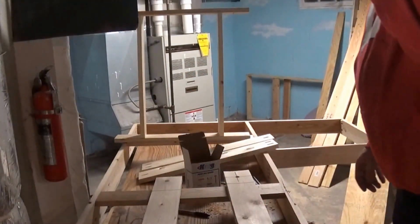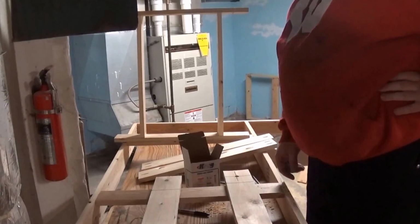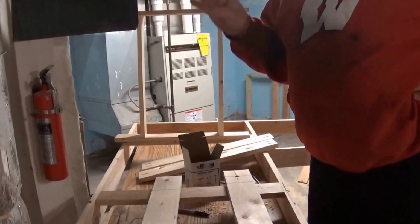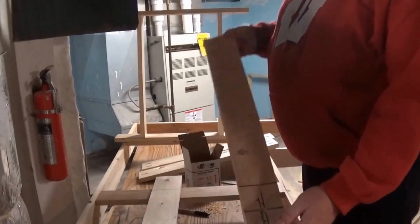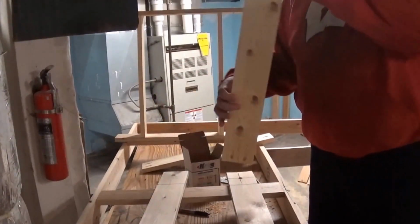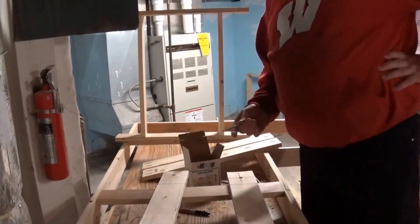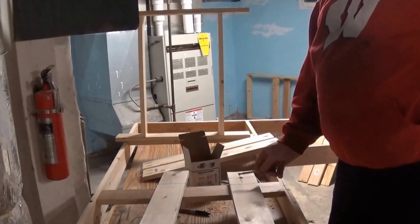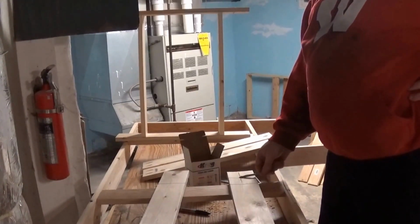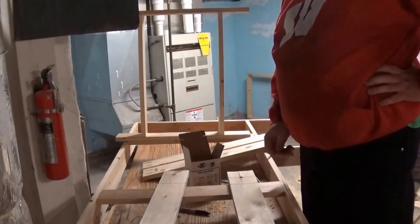Okay guys, so I was just going to do a short video on how I put my legs together. I've had some problems with recording. I ended up with my card being too full, and I had to restart the video. Anyway, this is going to be the foot, and this is going to be the top unit. These units here are my center spars that go in between. They're approximately 24 inches. Actually, mine aren't 24 inches exactly. But what I did on this is it's exactly 5 inches from the edge of the board to this black line. Same on this side from the black line to the edge of the board. It's 5 inches. Then this hole is at 2.5 inches. This is at 2.5. I drill a 1/2 inch hole because that's what my T-bolts fit.